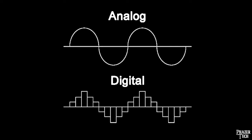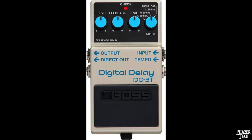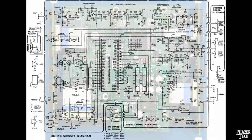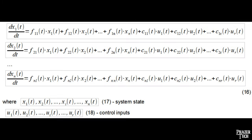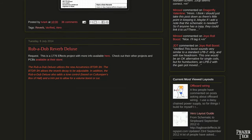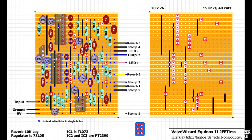Something to keep in mind is that the vast majority of guitar pedals are analog circuits, not digital. Some exceptions are modern reverb and delay pedals, which are mostly digital. You won't really find many schematics for these, because recreating a digital pedal is much harder to do than building an analog pedal. The circuits found in digital pedals are typically much larger and complex, and they use many surface-mounted components which are much smaller and harder to solder compared to through-hole parts. Most of them also use microcontrollers that require advanced knowledge of DSP programming. There are some exceptions though, and you actually can find some stripboard layouts for reverbs and delays, but they're pretty basic and are more like hybrid pedals that are mostly analog but also contain a digital IC that provides basic delay.